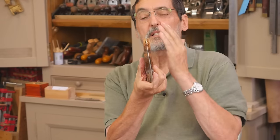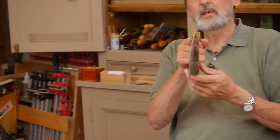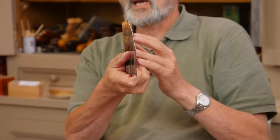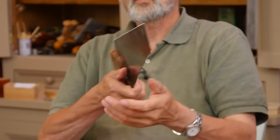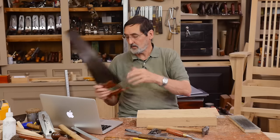If I look down here and it has a slight curve, what you do is go the opposite direction quite vigorously. I'm going to put a bow in it — so you can see now I've got a fairly consistent bow along the length. All we do is go exactly the opposite way, quite vigorously. I've now got a bow going the other way, that's no good, so I just go back this way and now I have a dead straight saw. It's just a question of boldly going where no man goes.